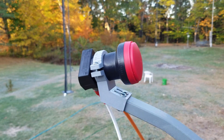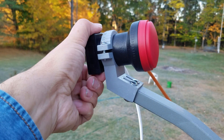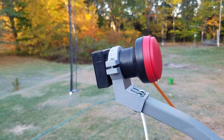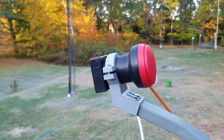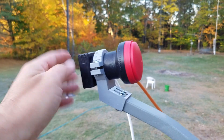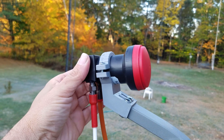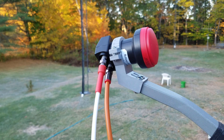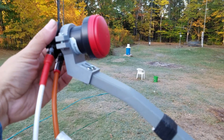If the depol figure were minus 90, I would continue rotating counterclockwise to 90 degrees — at that point, even though I'm using the vertical probe, I'm actually running horizontal polarization because I've rotated 90 degrees. That would be the minus 90 setting. If the depol figure were positive, say plus 45 degrees — which I probably never actually see with Europe — I'd simply rotate clockwise for positive rotation.